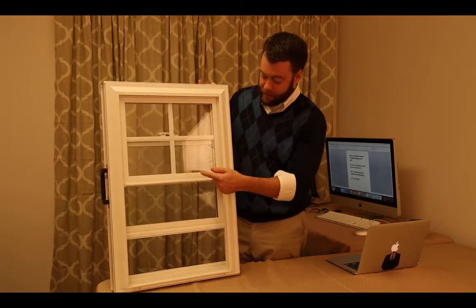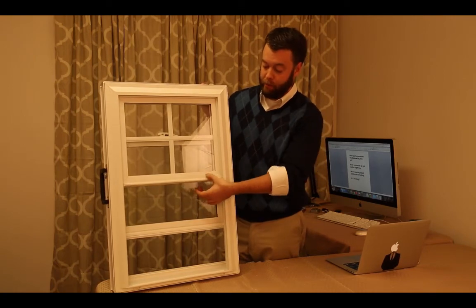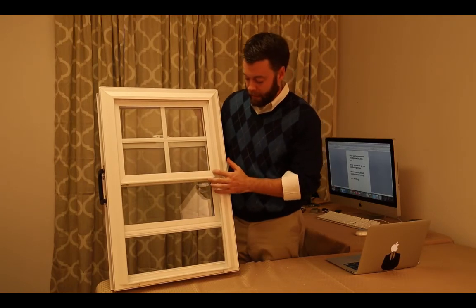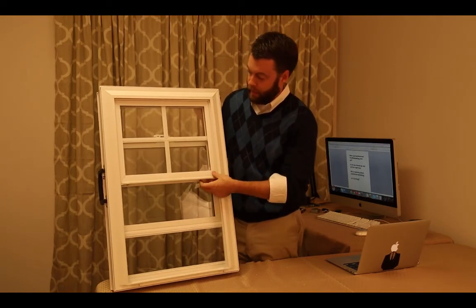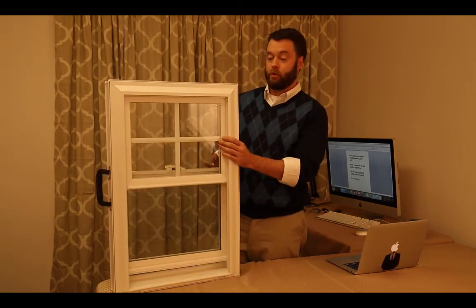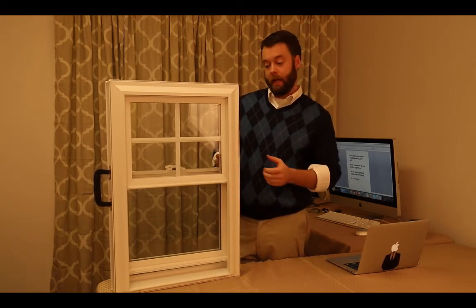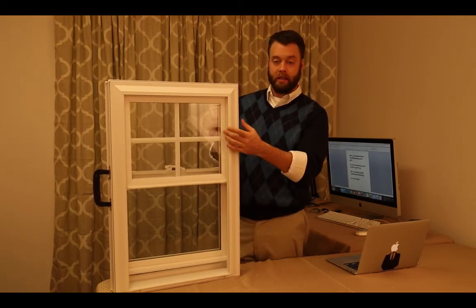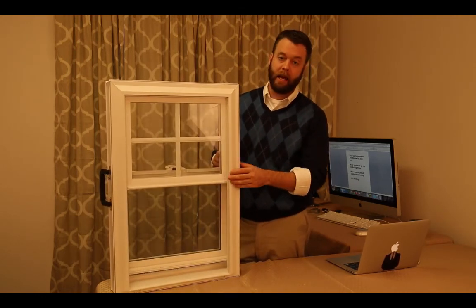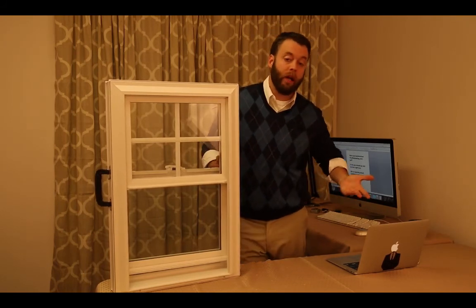Lastly on the outside, you'll notice the glazing bead — the vinyl part that holds the glass into the sash — has a nice mitered cut and it's a very slim piece. This product was known for being a slim frame and it continues that with the slim glazing bead. The mitered corner is a nice touch to give it a wood look or a nice finished look on the outside. That does lead to one drawback: it's not available in triple pane glass. Because it's such a thin sash — 7/8-inch glass pack — it can't support the weight or depth of triple pane, which is typically one inch or an inch and an eighth. But it's a low-end product, so they're not going for triple pane.